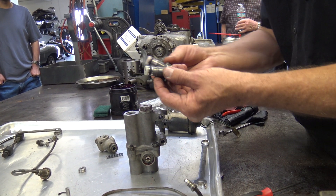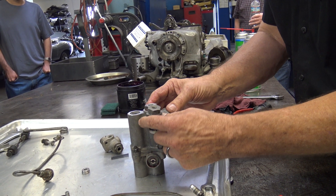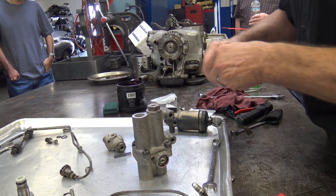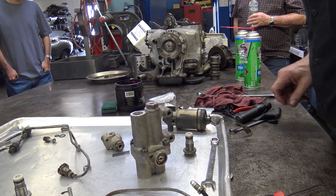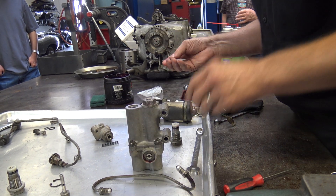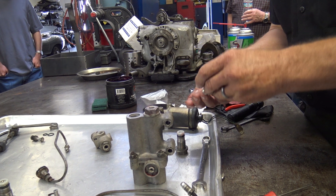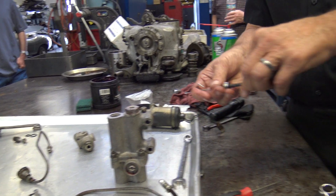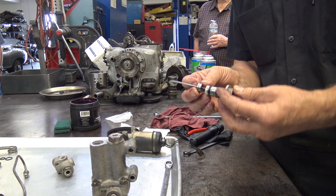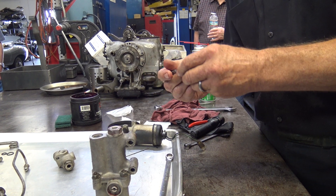Here's where we can get confused. We've got to remember we've got the one with the spacer washer. One real easy way to remember: both the fat washers go on one side. We'll go ahead and give this some lube. When we took it apart — I laid all this out for you guys — the way this goes is like this, sitting inside the car and in this housing right there. This other valve comes from the other side and sits in there, and it's spring loaded.